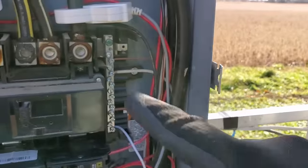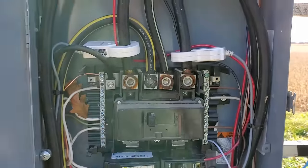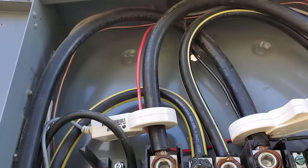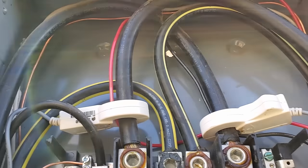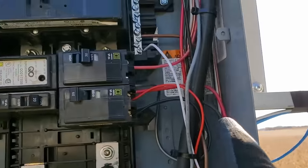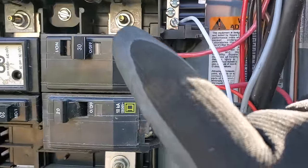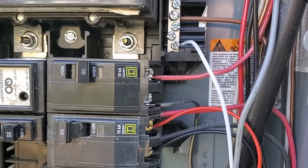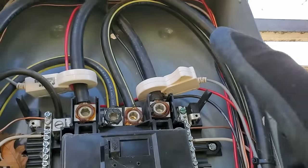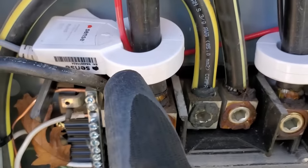We'll strip back about a half inch of insulation and open up those terminals on our new breaker. A question for electricians: how many of you use a torque screwdriver? All these connections have torque ratings in inch pounds — let me know in the comments. Our wire is run up right through here. I ran my neutral and ground wire all the way up across the top and tied them in. Our wires ran up and terminated into our new double pole breaker for the generator, but I ran them through my Sense energy monitor clamps.